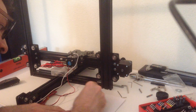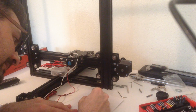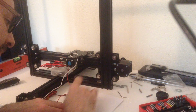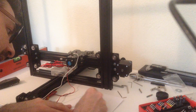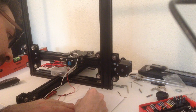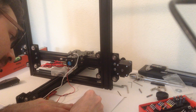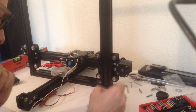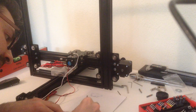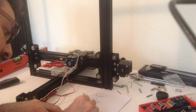But if I zoom in on one side, what was happening in fact is that it wasn't putting the side rail true and vertical with the bottom flat rail. It was in fact keeping the same 90 plus angle because the brackets are very sturdy, and while the side was vertical, it started lifting up the small rails. So in fact I was every time ending up with a printer with a base that wasn't flat and which was rocking all the time.